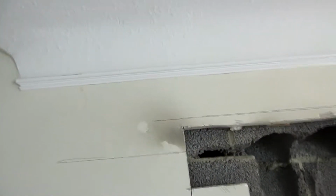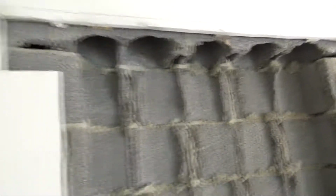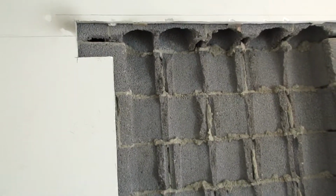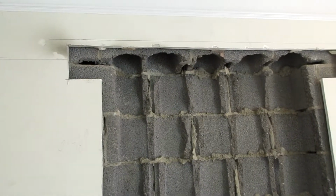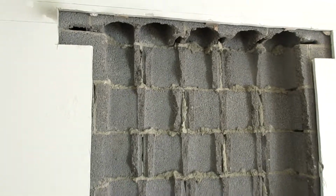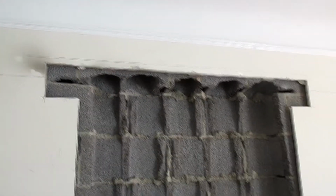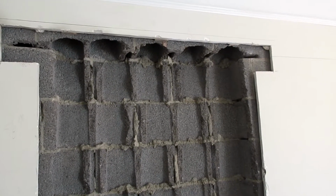After cutting this, I realized that I need to cut this drywall a little bit more across the top on this line right here, so my piece of steel sits flat against the cinder block and I could get some tap cons and then I could mortar it in place. So without further ado, I'm going to cut that drywall and I'll be right back at you.